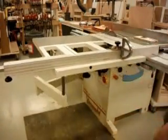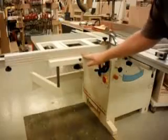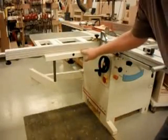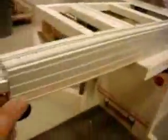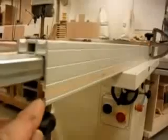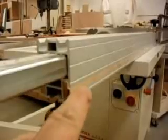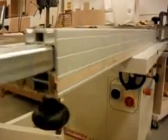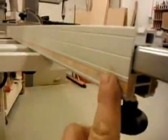The other thing I've discovered is when it came to doing miters and 45s, well, a half-inch piece of material, I can do a close-up of that. I've had to cut a piece of wood to fit in this groove right here, because my half-inch piece at 45 would slip in that groove. It was really daft, I think, that design. And likewise on the other side. I've slipped in some maple there to make this flush, so my miters don't slip in.